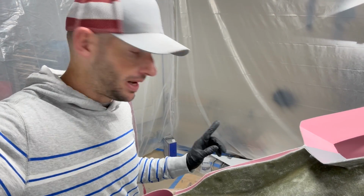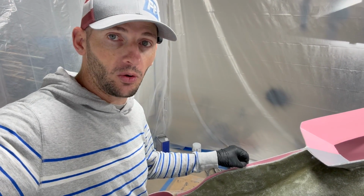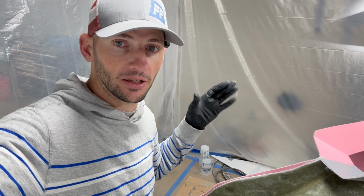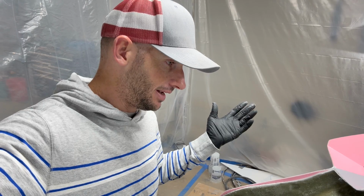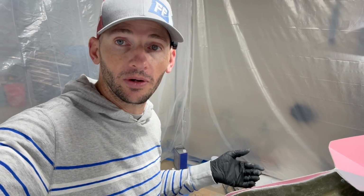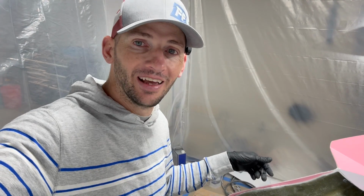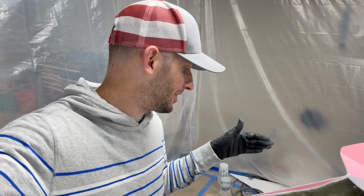And one more thing, my bright idea to put duct tape on the edge of one side of the mold to prevent the resin from sticking into it, and then also giving me a spot to put my wedge in there and pry them apart, clearly there's a reason why no one does this, and that's because you can put a chamfer into your mold as you're cleaning it up so that you can get a wedge in there for all the other times.